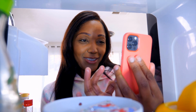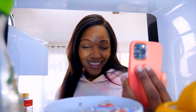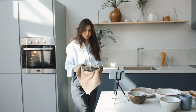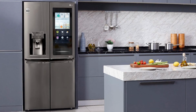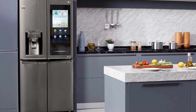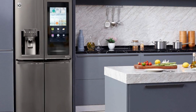Purchase some weather stripping rubber intended for doors and windows, and measure and cut it to size for your RV's fridge. Make sure that the corners are as tight as possible. Do not remove your old door gasket seal. Instead, prep it by cleaning it with some rubbing alcohol. Once it's clean, take your cut pieces of rubber, peel off the back paper, and stick it directly on the old door seal. Close your door and you should be able to feel that the seal is tighter. This solution is not as effective as replacing the door gasket seal, but it is by far better than rolling with a damaged seal that is letting cold air fall right out of your fridge.